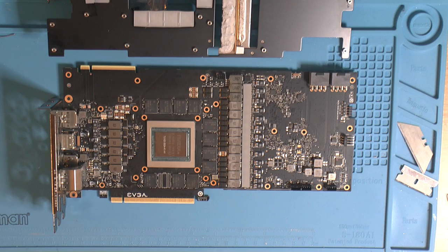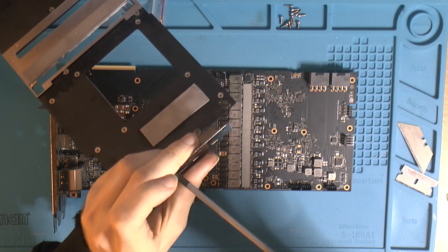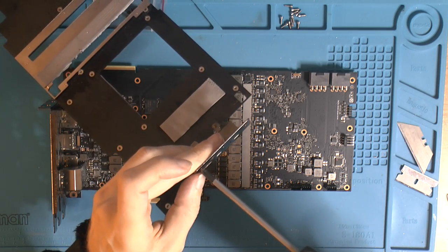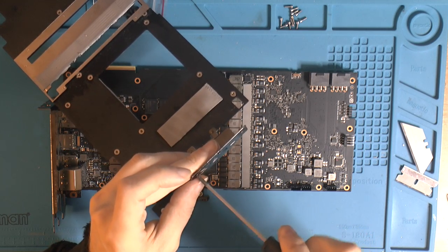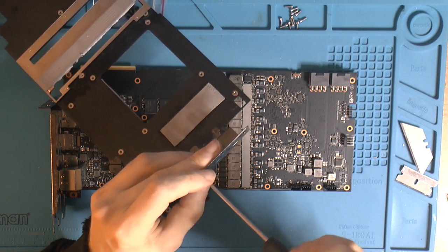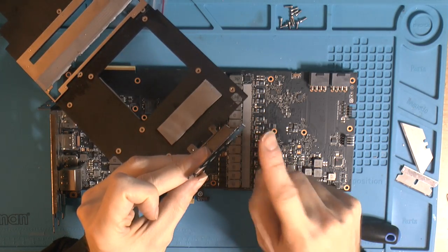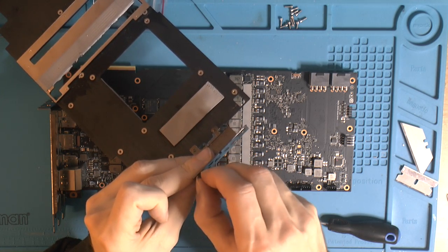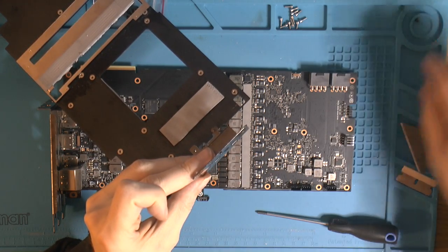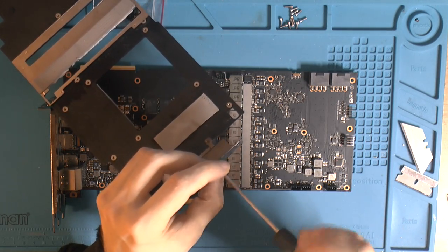I think we're ready to put on the front and back plate here. Remove the screws. I know a lot of people put the screws in trays and stuff, and I do if I have to, but when I disassemble something I have to leave for a month, especially then, I put the screws where they went in. So even if there is a plate covering this one, the threads are there, so I can put the screws in there. That way I know where they go. Very good way not to lose the screws, and know where they go a month later.